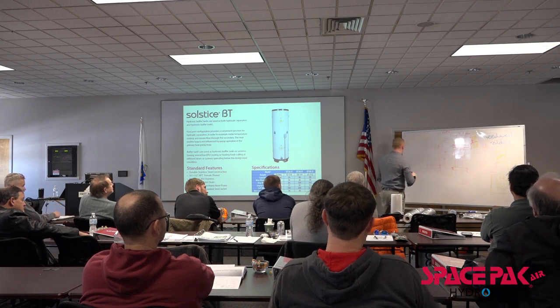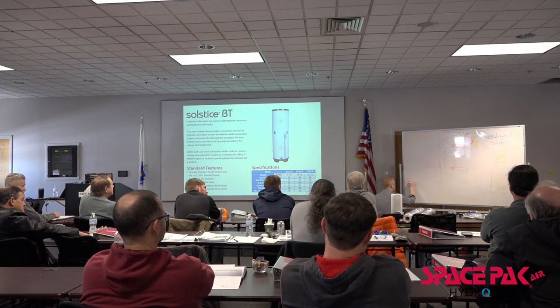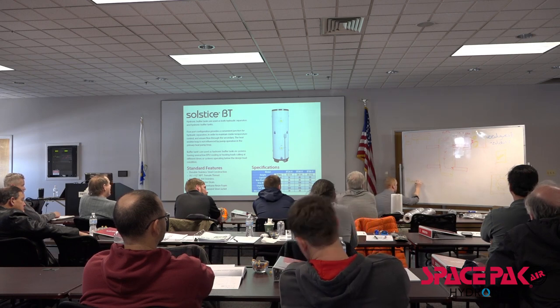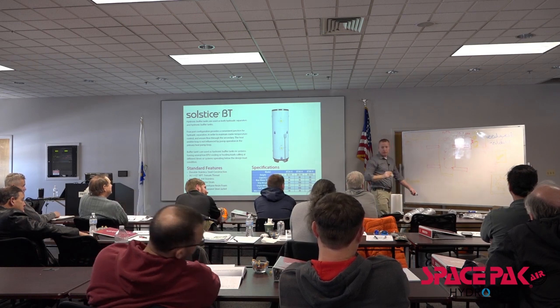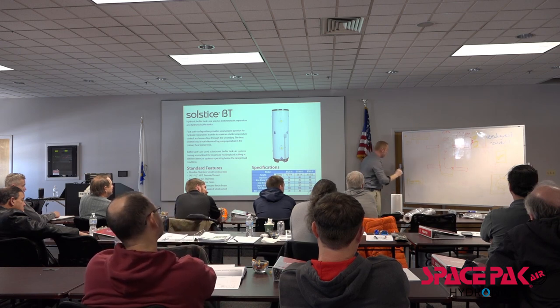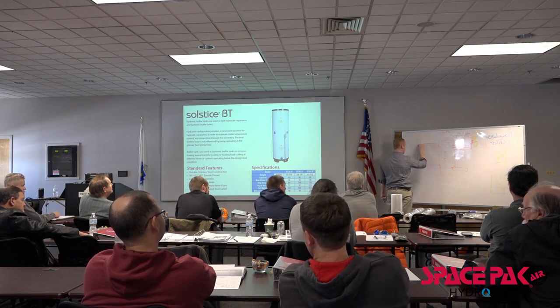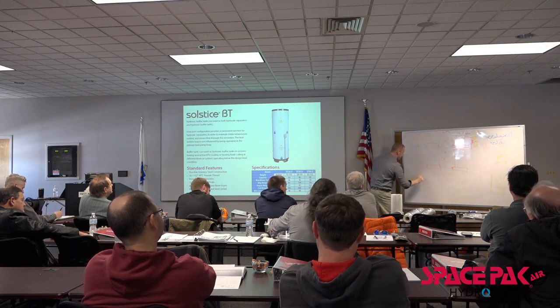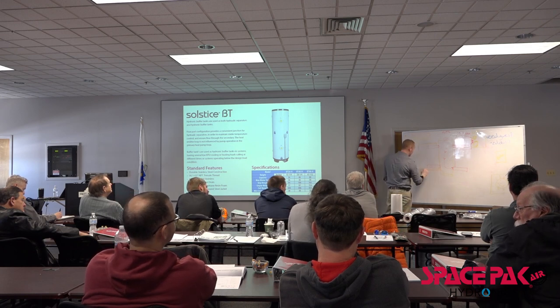Now, here's our high wall unit. I'm doing this just for you so you can be right. How many GPM are we going to run through our high wall unit? 2.5. Okay, so that might be the first unit that comes off. So here we come, 2.5 GPM to there. We come back out of here and go into our manifold again.